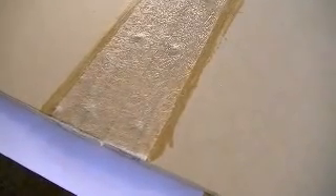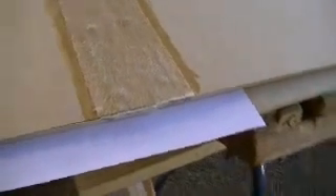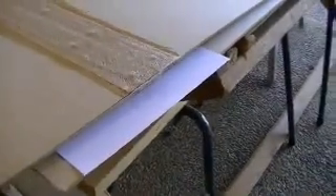Here we have the joining of the extension to the bottom — one half of the bottom — of a new boat being developed. When they're joined together there may be a point where one small portion is a little bit wider than it should be, and you'll notice here I've just drawn a line to fair that in. Then you can just cut off that excess bit and run your eye along it to get a nice fair line. That is joining the bottom of the new 11-foot dinghy.